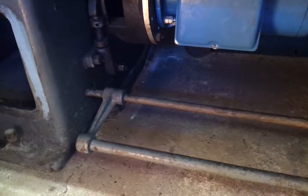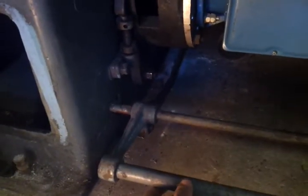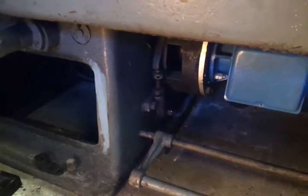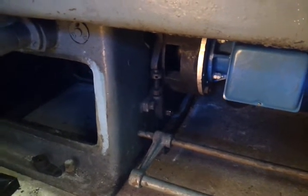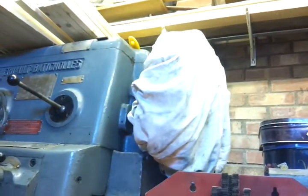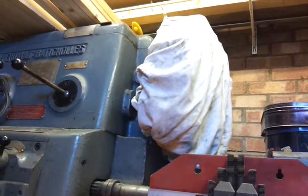It's a mechanical and electrical device fitted on most big lathes. You can probably see the arm going up and down there — that's normally attached to a strap, and that strap fits round a big collar in there. Once it tightens down on that, it makes it almost impossible for the motor to turn round — it slows it down real quick. In fact it's so quick that if this is going at pretty high speed, it would be enough to damage the gears inside. But at low speeds it would definitely stop pretty quickly.